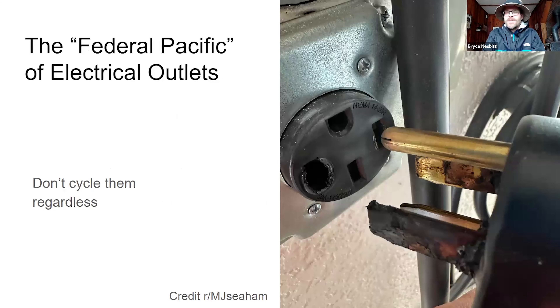If you see an EV charger, you're going to have to decide what to do. This webinar is meant to help you decide if you're going to inspect it or disclaim it. I promised pictures of melted outlets, and here's your first one right up front. This is a melted NEMA 14-50R EV charger outlet. You can see all of the plastic on the plug that's being removed.